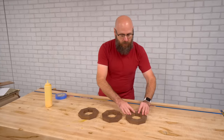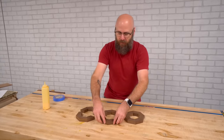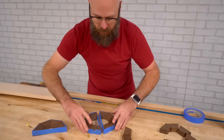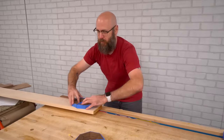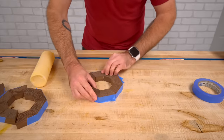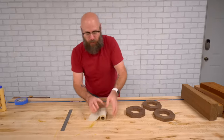Now we're going to glue these in halves, and when the glue dries we can sand the face of these flush, and then they'll go together perfectly — that will eliminate any gap we had in our angle. I don't have to tape these joints super tight because once we get these together, they're going to be glued face to face on the other board. Now we sanded them so it's got a nice clean edge and they'll meet up perfect. Now these segmented rings are dry and I need to sand the face of them flush so it glues down properly.